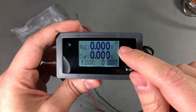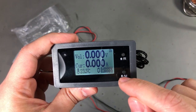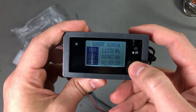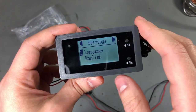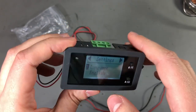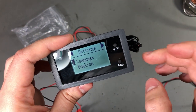On this type of screen I get a small connection icon — I'm not sure if it has any Bluetooth module built in, but it's possible it supports one via that UART port. It even has a menu for configuration where you can access various settings and configure alarms for over-voltage, under-voltage, and over-current situations. It also has a buzzer on board so whenever an alarm is triggered you'll get an audio alert as well.